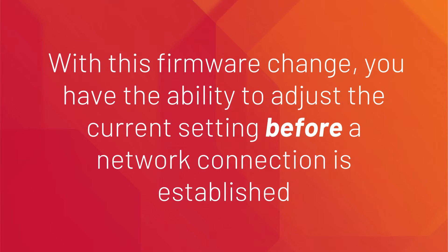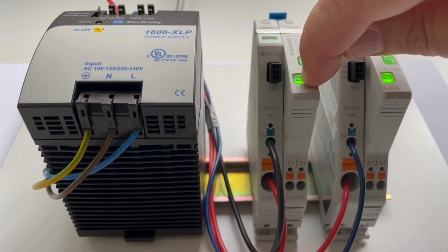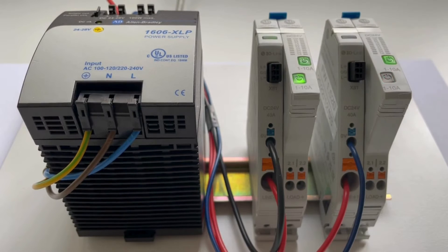Please refer to the demo video. On the left-hand side, you see the solution as it was. I push the micro switch for longer than 3 seconds. The red LED indicates a separator. One amber blink means the channel is set to one amp — this is the factory setting. The device repeats this multiple times; this is the readout process. Setting a current was not possible.